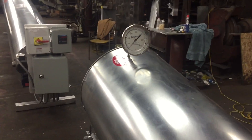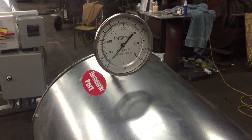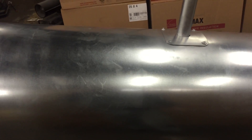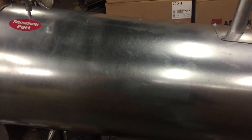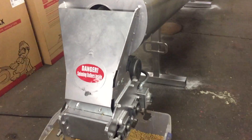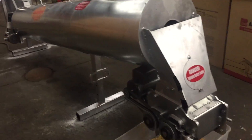I put a thermometer on the end that gives you an idea of the temperature of the beans as they're cooling down and coming out of the end of the roaster. The machines don't have any heat applied to them from here back — that acts as a steeping chamber for the beans to cool down, so that when they come out of the machine on the end down here, you can put them directly into a pile. You don't have to cool them as you do with flame roasted beans.